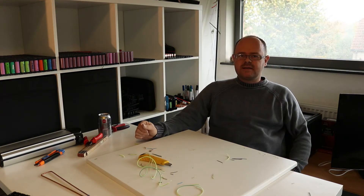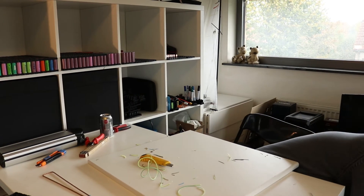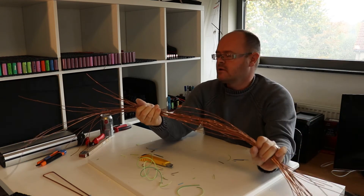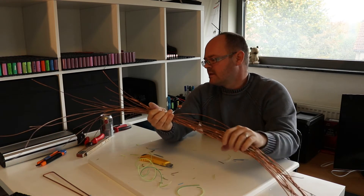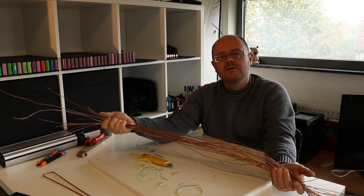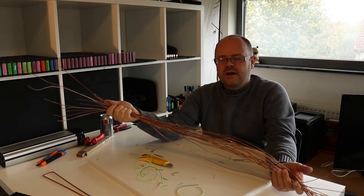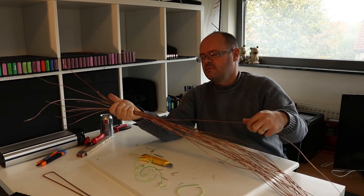The first strands are peeled and this is all raw copper, a length of 110 centimeters. As you can see these are not straight, so the first thing we will do is straighten them out. Then sort them per three, and if we have three strands we will make a twisted bus bar out of them.